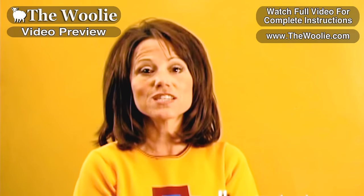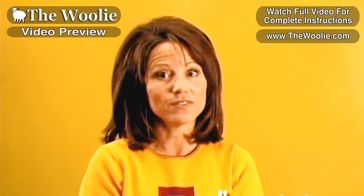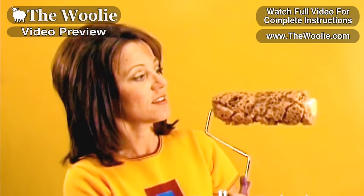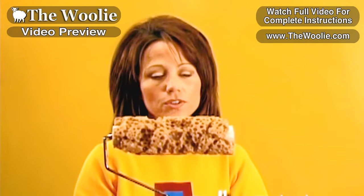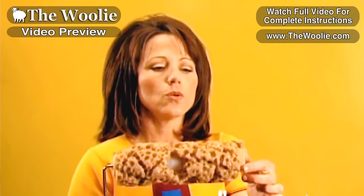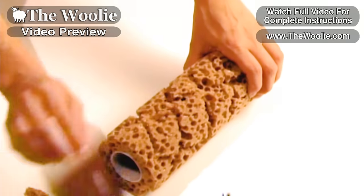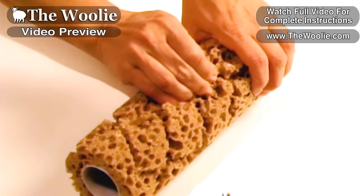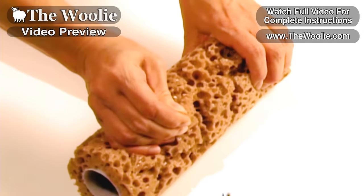The next technique we'll be doing is sponge painting, but this is different than any other sponge painting you may have done in the past. We're using the sponge roller. If you look closely at my sponge roller, it's got big chunks missing from it. The reason why is this creates the variation. You should take the sponge roller and pull pieces out to create a random pattern, which is desirable on the wall surface when you're painting.